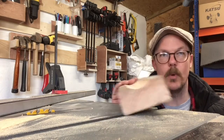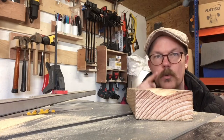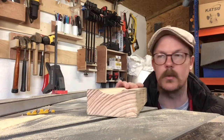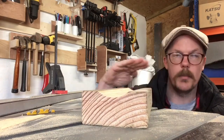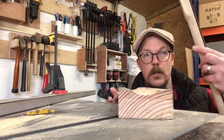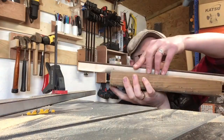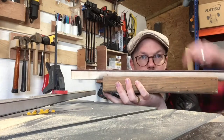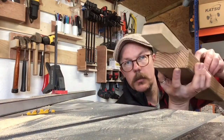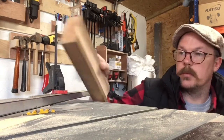If you want a smaller radius to your cut, present your piece to the blade at a more acute angle. The more you open up that angle, the wider your cove becomes. I'm using it so I don't present any sharp edges, but I do want it supported along its length so I can bang in some frets. This does a nice job of that without presenting any sharp edges and damaging the wood.